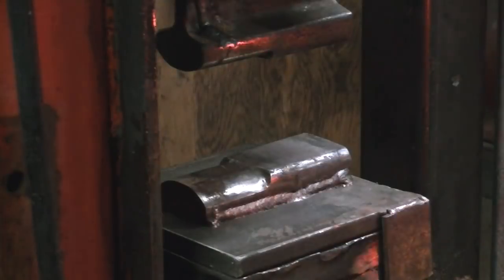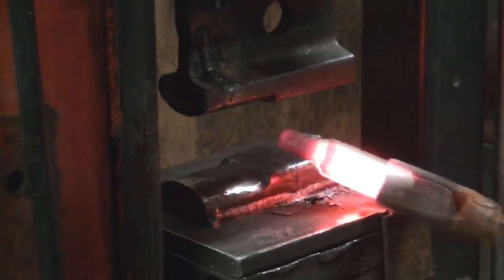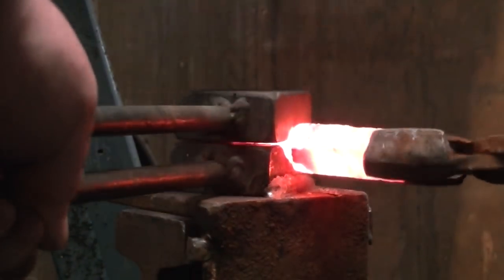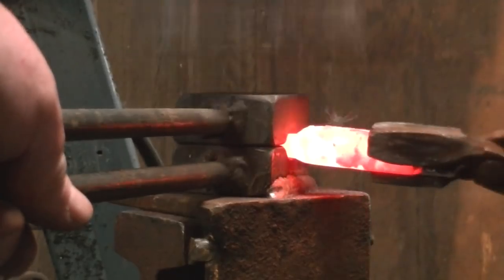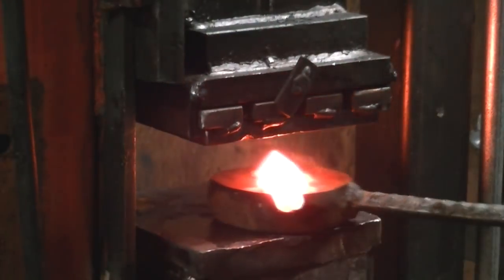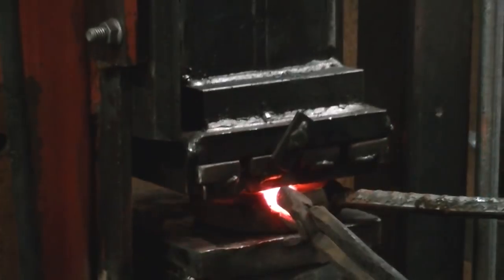These first ones I'm putting through are wrought iron — I want to see how wrought iron reacts with this. That area we're squeezing down is going to be our stem area; we're just getting a rough shape there for now. I have about as much material as I think I need to fill that mold — there's going to be some experimentation here. We're going to get this guy into some tongs, get him heated up real well, and put it diagonally into this mold and take a bunch of bites. Didn't come out too bad! We'll do some comparison and see if we need to make any changes.